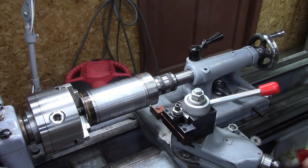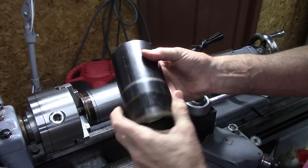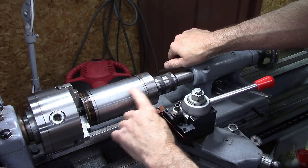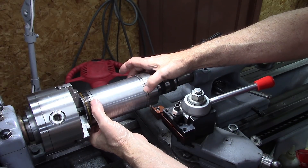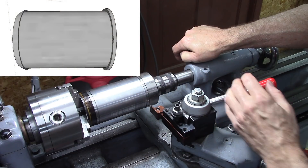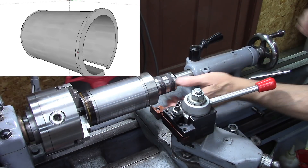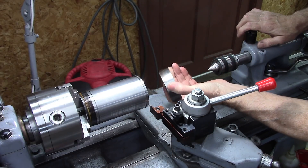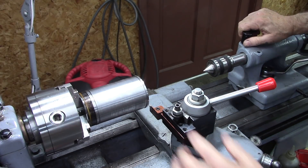What I have here is a piece of pump sleeve — industrial tubing — and I cut a section off it. This is going to be the adapter sleeve for his drill press table. I'm going to turn it between two shoulders and leave those areas a little larger so it snaps into the bore on his new table, then bore the inside to two and a half. These two grooves are cut to the depth of the final diameter. I've got it supported by expanding my chuck inside the tube, with a scrap of steel on the end running a live center.